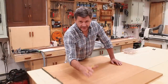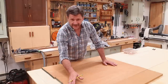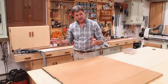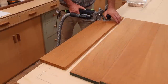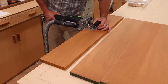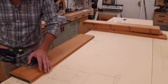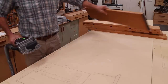I've taken a few minutes to set the boards up in the order that they'll be joined together. I've got the center cut where I cut the boards in half all on the left side, and the ends are all on the right side. That way if there's any checks or imperfections they'll be cut away. I'm using a domino just about every nine or ten inches — the dominoes will add strength to the joint and keep the boards aligned during the glue up. If you're making this table for inside, go ahead and use the biscuit joiner, though biscuits really don't add strength to the joint, they just help keep boards aligned.